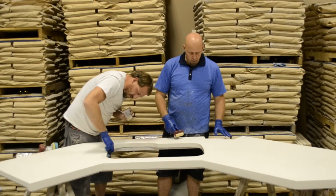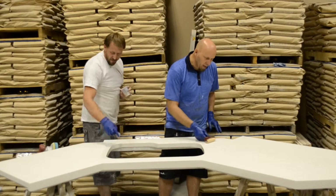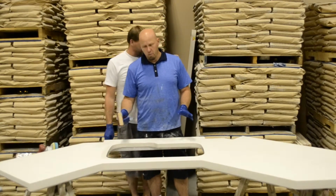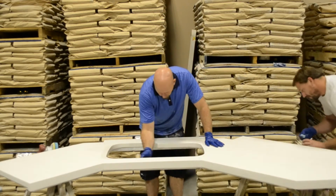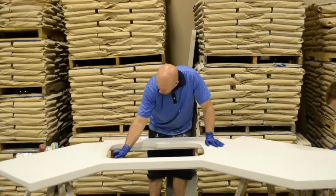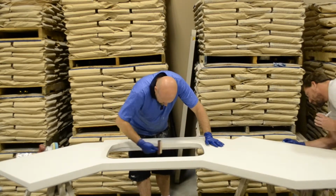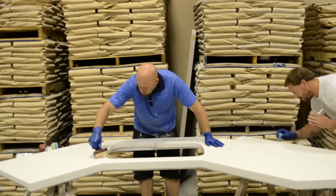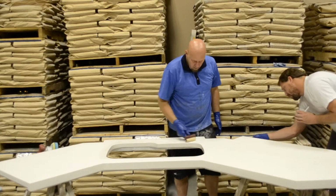You'll especially notice if you're rolling out your surface, if it won't roll and it's sliding across, you have too much material. You can also have too little material, to where your lines aren't going to disappear. So now I'm just going to back roll over what he's done here. I'm also going to back roll over this top surface anywhere he's gone over it, and flatten that out a little bit before we get to that.